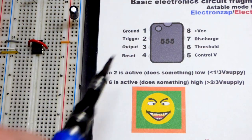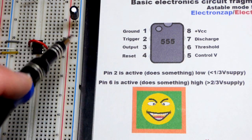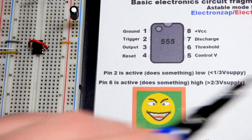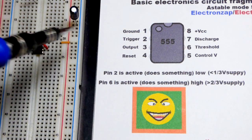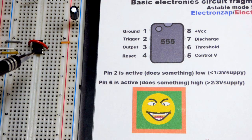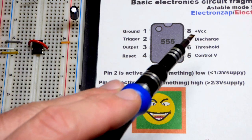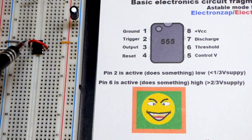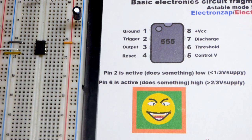To begin the build, I've cleared off the components. This capacitor is helping to stabilize the rail — this power supply sometimes gives an erratic voltage that throws off the 555 timer. We have to power the 555 timer: pin 8 goes to the positive rail, and pin 1, the top pin, goes to the negative rail.